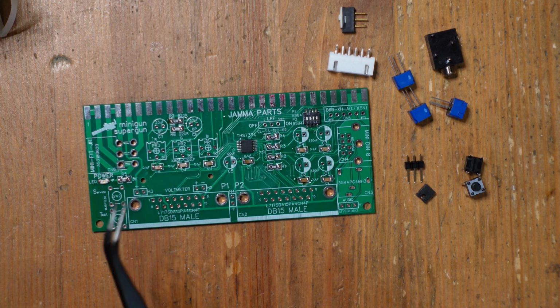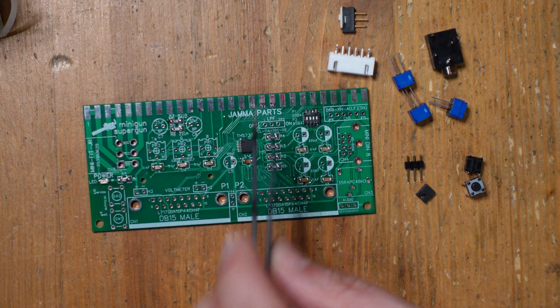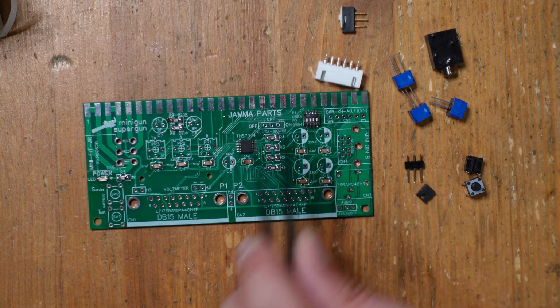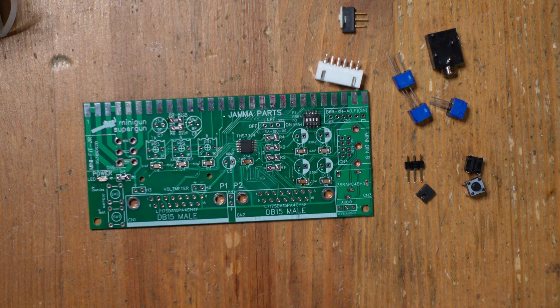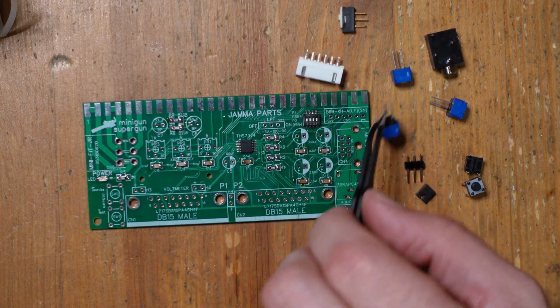All right, so now the project keeps getting easier and easier. What we have left to install are all through-hole components. So we've got this one here. This goes to the kick harness, and what the kick harness is for certain games, like for example Street Fighter 2, which have extra buttons, up to 3, that are not present on the normal JAMMA standard. Normally those are mapped to the kicks in a fighting game, like weak, medium, and strong kick, and so hence the name kick harness.